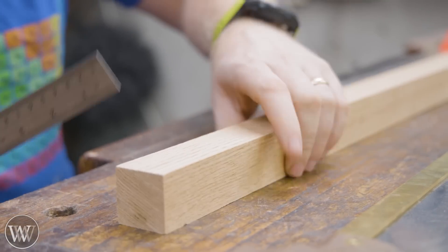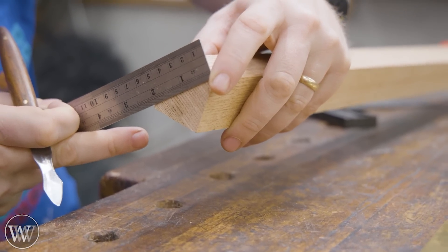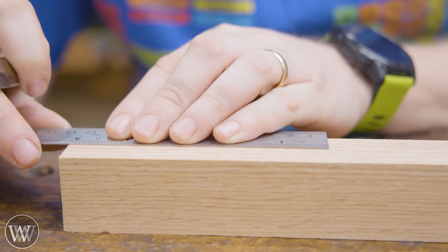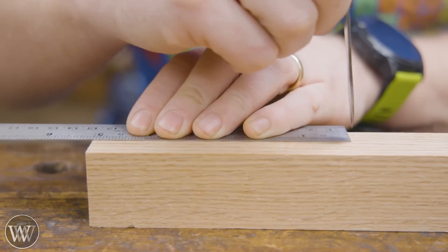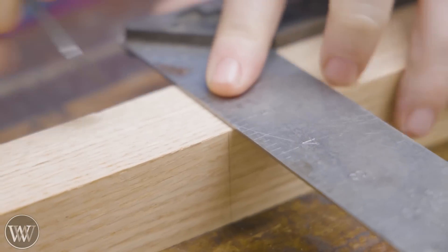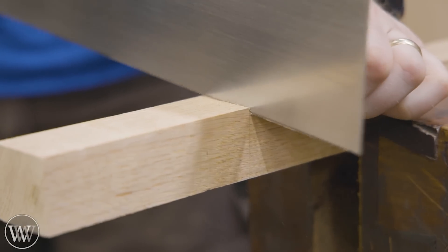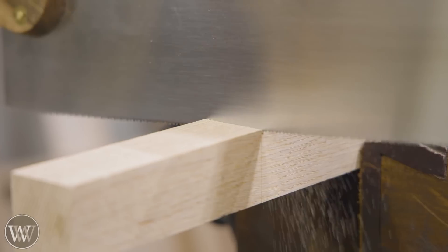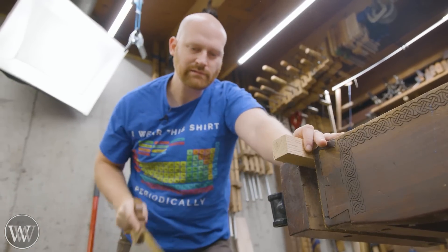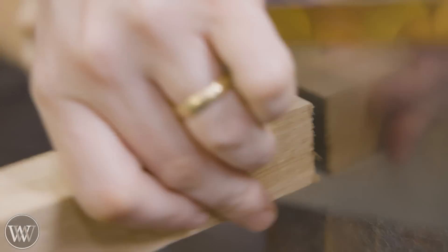This project is going to start with red oak. I had this stick of red oak that's inch and a half by inch and a half, and I figured it worked well for this. The first measurement you need is the diagonal width of the board. You need to make these sticks longer than twice the diagonal width — I added about a quarter inch on either end, so about a half inch longer than twice the diagonal width. You can make them any length you want, just make sure they are at least twice the diagonal width.